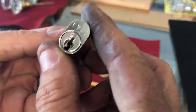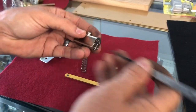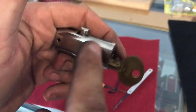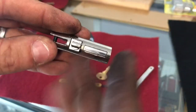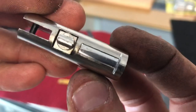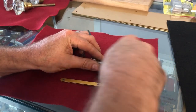So really what I'm doing in this video is we're going to look and see what's in that cylinder. Like I said, I've tried running something down the keyway to get whatever debris is in there out. However they had pushed and pushed on this, so it is firmly — whatever's in there is firmly wedged in the back of the cylinder. Normally you can take this cap, but these from the factory are sealed really tight, so I'm actually just going to take a hacksaw and cut across the top so I can pry it open. I'll put it in a vise, make a little cut, and then pry it open on camera.